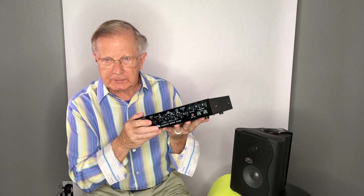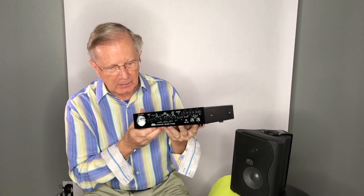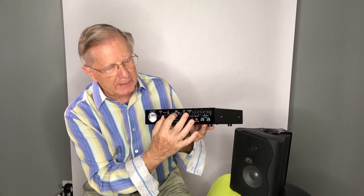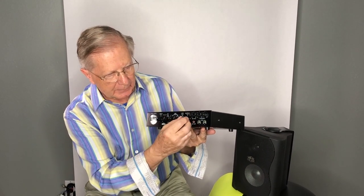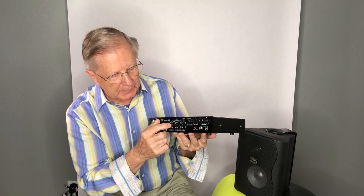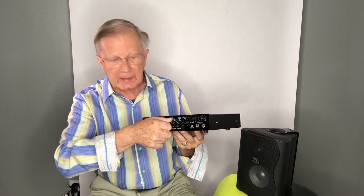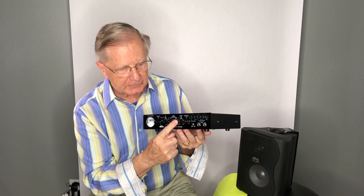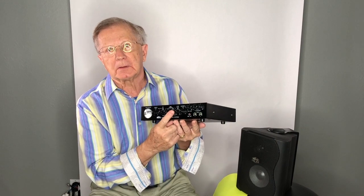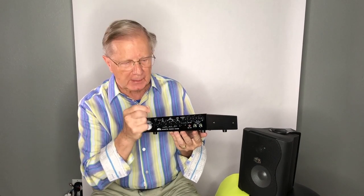This is a parametric receive audio system, and there are two components to it. First of all, this has three equalizers in it. We set the lower limit and the upper limits. The lower limit is sitting at 160 hertz, plus or minus 15 dB, and the upper limit is at 6,000, which you can cut or boost by 12. However, the most important thing is the midrange — instead of a fixed equalizer there, it's parametric, meaning you can change the parameters of that filter.